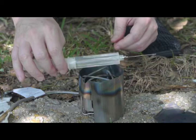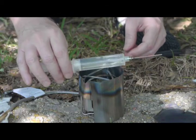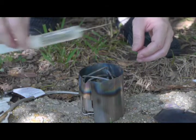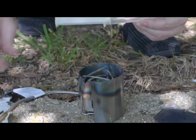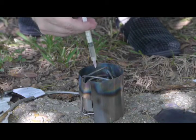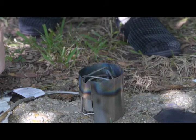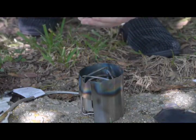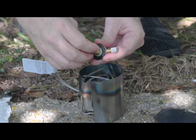This is going to be a simulated test of what it would be like in a real-world situation where your pump for your kerosene has gone south and you can't get a replacement in time. You've been smart enough to bring this with you, and of course if you're using the hybrid technique you've already got one of these adapters. So this is going to be a simulated test. I'm going to go ahead and put in the one cc of the priming alcohol — this gets things going. Up to this point everything will be identical to the way the startup routine normally is. This is the adapter and I'm going to attach it to this connector here.